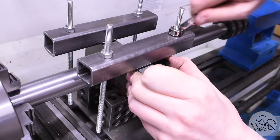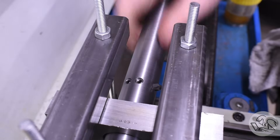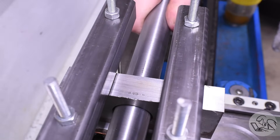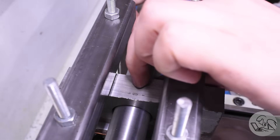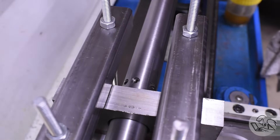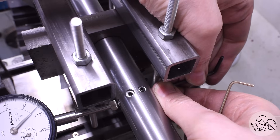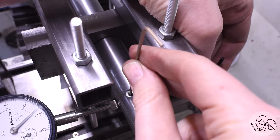For horizontal positioning you've got the cross slide, so that's no problem — the challenge is really just the vertical, getting that centered. This is a normal right-hand turning tool grind because I'm feeding the work left to right, so the tool bit relative to the work is moving right to left, just like a normal turning operation. You might need a left-hand turning tool if your carriage only power feeds toward the chuck. To set the initial tool bit position, you feed the work over the cutting tool, push lightly on the tool bit until it just touches the surface, then pull the work away — now you're touched off. Then I set an indicator on the end of the tool bit; a flat tip on the indicator helps a lot. You use the indicator to move the tool bit out the amount of your depth of cut — in this case 10 thou — then you're ready for your pass.